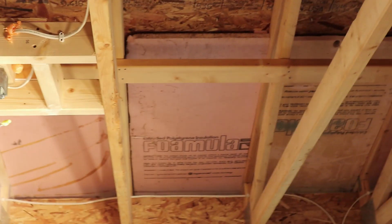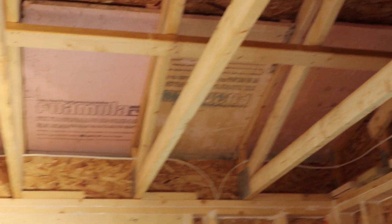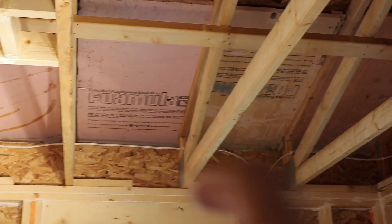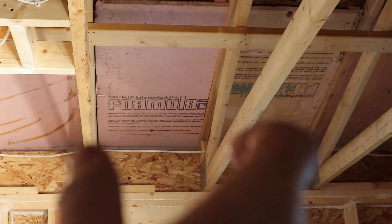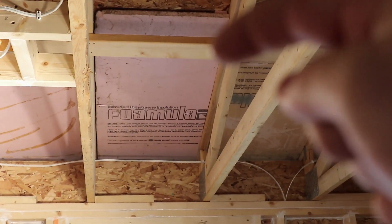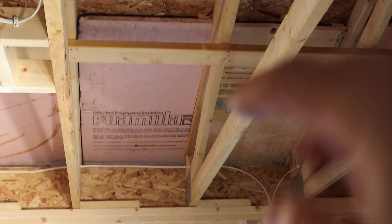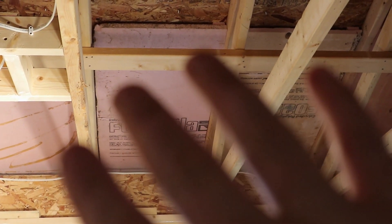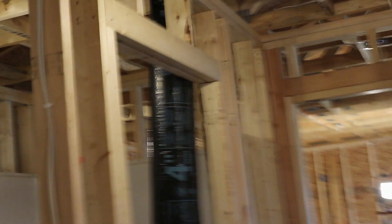What I'm doing here is I had some scrap foam downstairs and I just made these baffles up and glued them. The way I do it is 22 and a quarter inches wide by 4 feet long. There are blocks hot glued on the other side of it, and then I hot glue the panel up to the roof. Then I'm going to use can foam around the perimeter just to lock it in place. I'll show you cutting it, which isn't too exciting, as you can imagine.